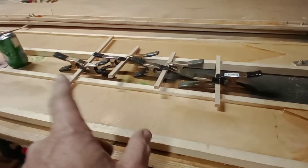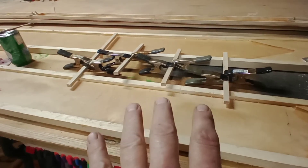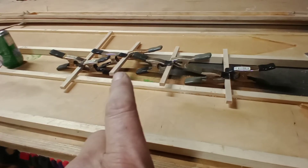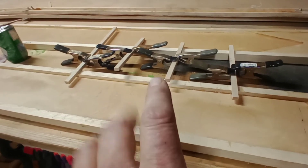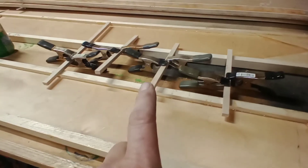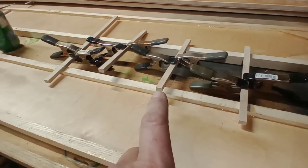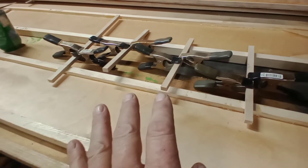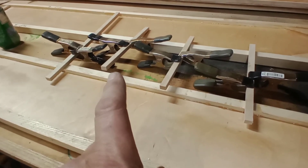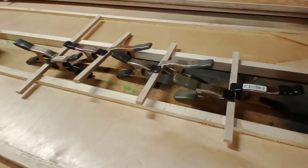So I did that and I'm redoing this test now. It's commercial white ash, which is very strong and it's a little more difficult to get the glue joint to be stronger than the wood. Nonetheless, my original tests used really high specific gravity white ash, and every time the wood broke instead of the joint. I'm going to see if I can duplicate that the way I did originally.